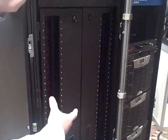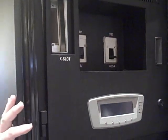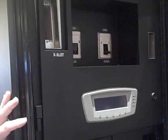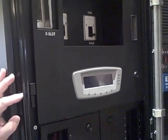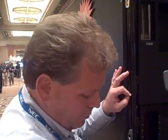These panel boards use our standard Cutler Hammer commercial style breakers. Up above, we've got two different main breakers, and those are 400 amp rated. The reason we did a 400 amp rated system is because in today's data centers, when you've got blade servers, you've got a lot of power required in each one of the cabinets. Having enough distribution and enough power available for those racks so you don't have a whole bunch of empty spaces is really what this design is all about.